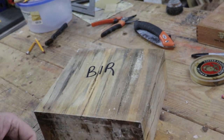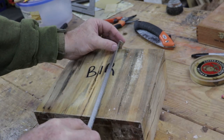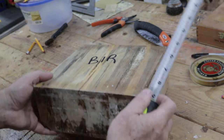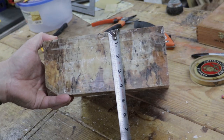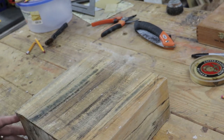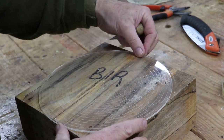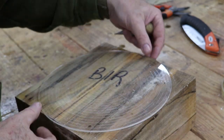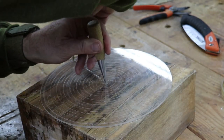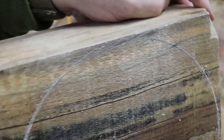This is a chunk of birch. I've had this on the shelf for quite some time. You can tell it had a wax coating on it. I took the wax off the side grains and left it on the end grain and let it dry out for quite some time. It's leveled off to right around 10% moisture content.